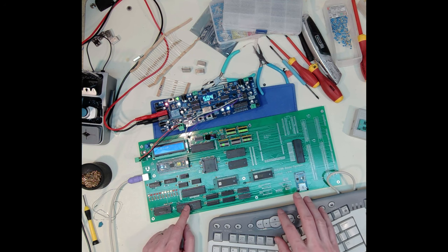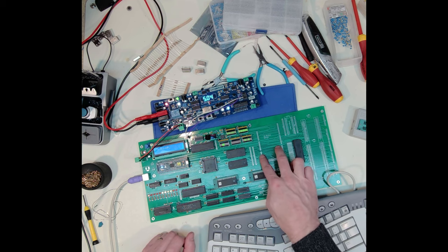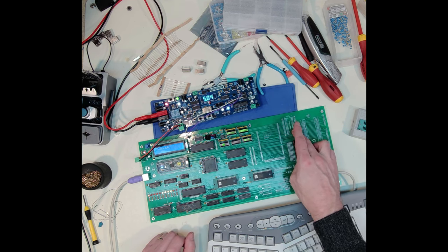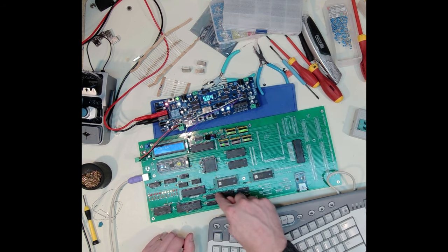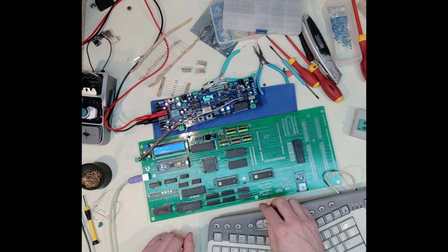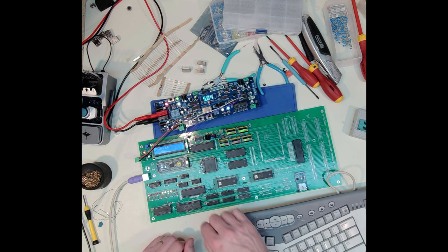So really, the things I need to test yet would be the math coprocessor and to get all of my SPI stuff running. And I'll get a Mega put on here, I'll get a Nano put on here. I'll fill in the rest of these caps. Most of these ICs I put dual, a 0.1 and a 0.01 microfarad. And for now, I just put in the 0.1 microfarad caps everywhere.